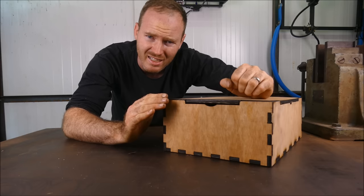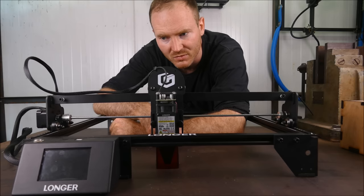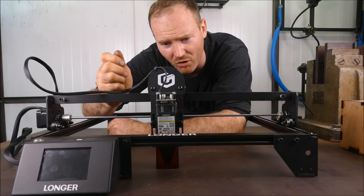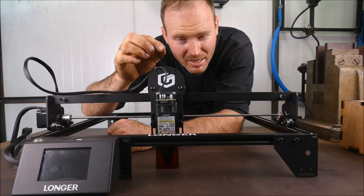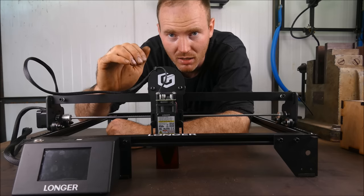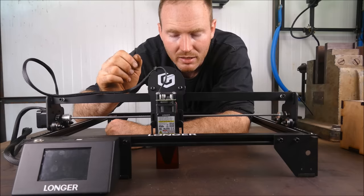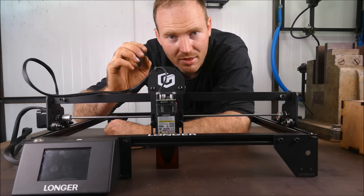Those results are awesome — I can't complain. A box like this will last so much longer than a plastic or thin tin one. Now for my conclusions and design recommendations: this is a great machine, but my preferences for improvement across the board — not just Longer — would be a drop-down height adjustment feature with a fine-tuning screw you can turn by hand rather than the current height gauge. All desktop CNC lasers should have an offline controller built in — Longer did a perfect job with that. All models should also come with air assist, even just a nozzle input so you can connect a compressor, because it makes a massive difference when cutting.